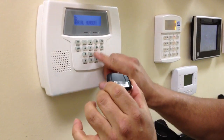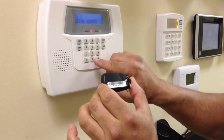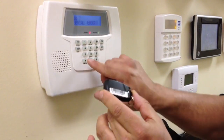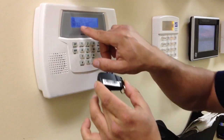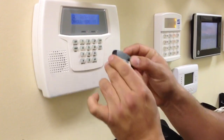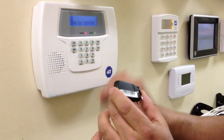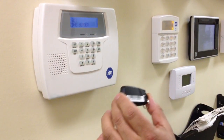Enter the serial number: 0-7-6-9-2-0-7. Then you hit star. You'll see in enroll mode it shows the actual serial number you just put in. Then you press star. Zone descriptor — you press star again to pass that, and you're automatically on the next zone.